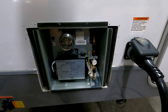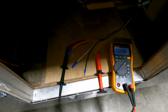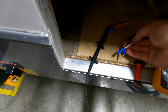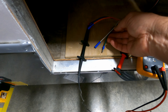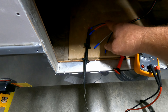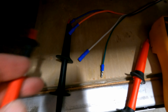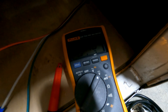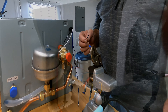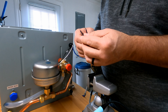Back in the shop today working on a couple little projects. The new hot water heater is in the opening where it fits. The Atwood was a little wider, and they accommodate that with the new door system. There's approximately a little over an inch and three quarters on both sides, so I ordered a piece of inch-and-three-quarter by inch-and-three-quarter aluminum angle with an eighth-inch web. I can screw one side of the angle into the aluminum frame of the trailer, giving a nice flat surface to mount the new hot water heater to, and seal around it very well.